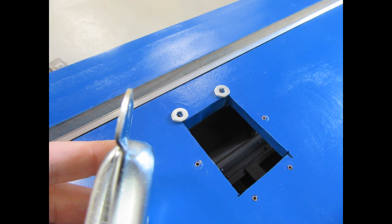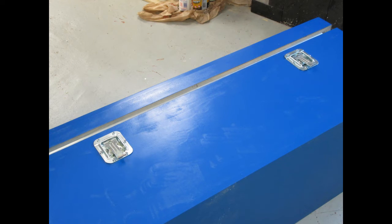The latches are of a type known as valance spanning, which means that one end is raised to have clearance over a valance used on the nearby case edge. Since on this case the valance is mounted inboard, 2 small metal washers are used to form spacers at the 2 holes under the raised portion of the latch. Here, both latches have been mounted using sheet metal screws into the reinforcing wood behind the masonite.